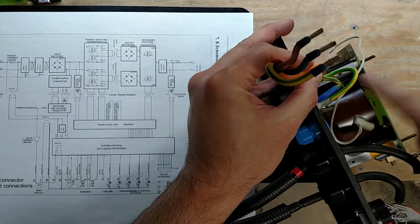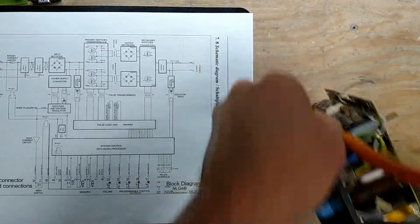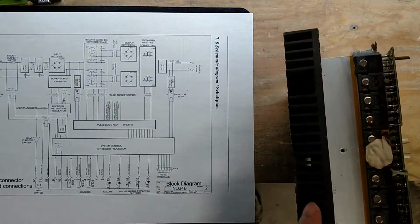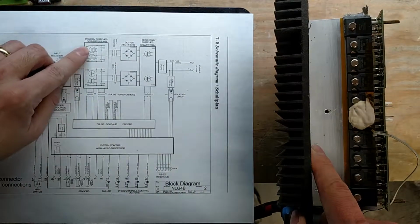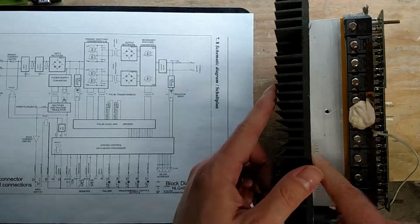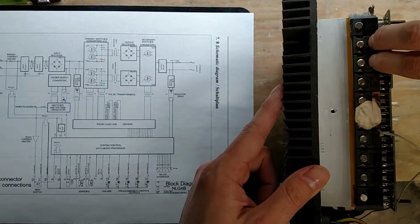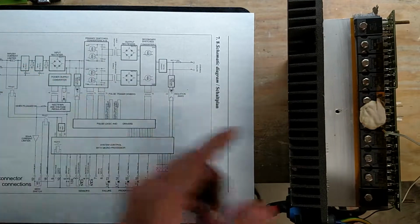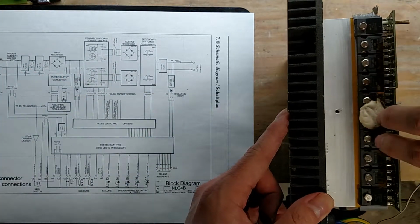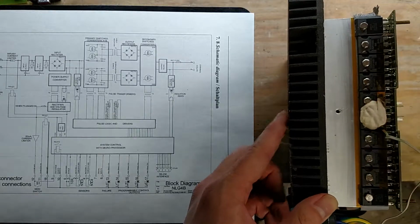There's another diode in here. So that's the bridge rectifier for the power stage. It's made up of 4 individual diodes. And then these switches here are located, this is one bank, this is another bank, and then these 2 switches are this guy, these 2 and these 2.